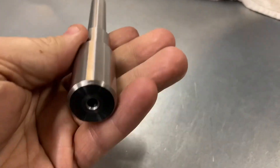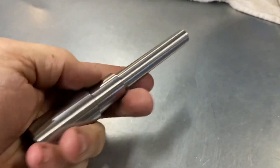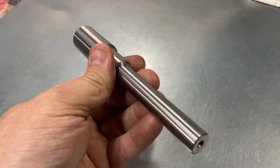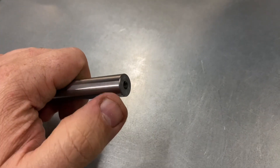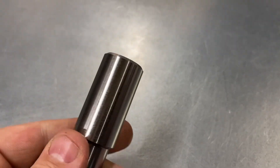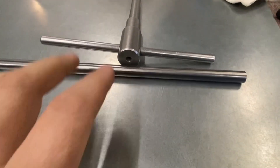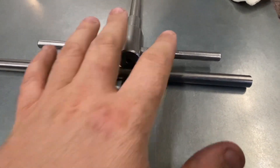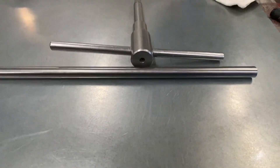So this is what we've got so far — have a closer look now it's off the machine. I haven't gone for perfect finishes because this is going to be a tool that gets dropped and bashed and clanged; I've just gone for a normal clean finish so it doesn't hurt me and it's nice to handle. We're going to go over to the milling machine, put the hexagon on the end, then drill the hole through for the tommy bar. In terms of tommy bar length, the original length suits the other chuck, but I feel a little bit more leverage might be required, so I'm going to add an extra inch to the length.